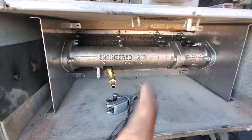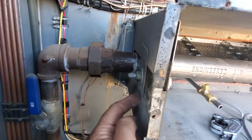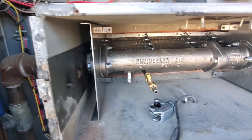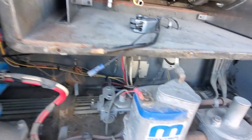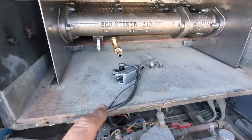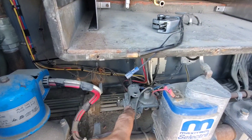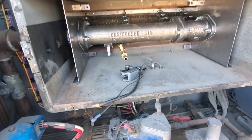We're getting places here — the new burner is in. The union needs to be tightened up, the plate is all fastened in. I'm going to put new connectors on these, and I also cut out the old pilot tubing that runs from inside here down to the gas valve. I'm going to run new tubing and put on new fittings as well.